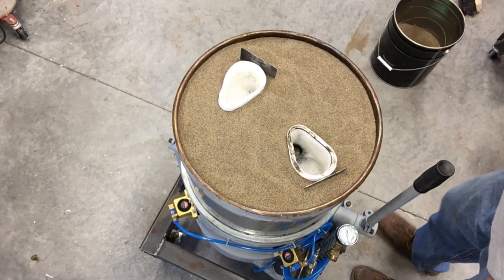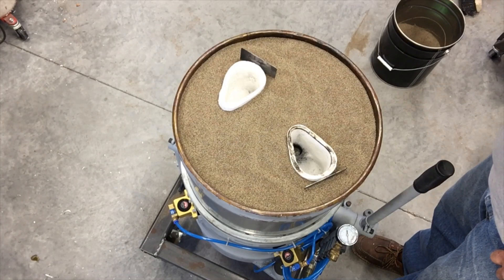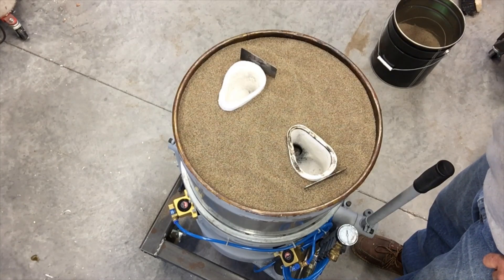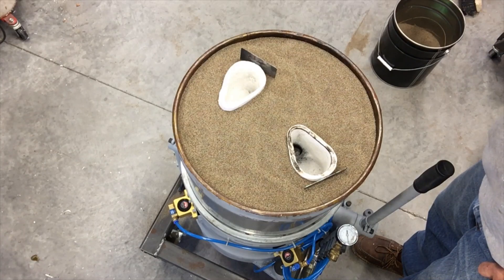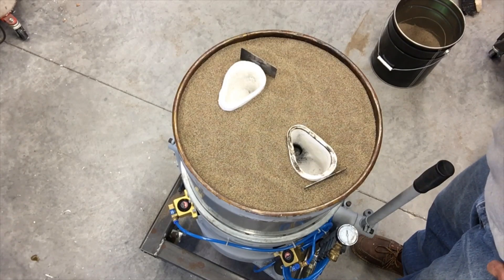The mold is packed and ready to be poured, and hopefully successfully. I've got the A20 all loaded up — probably should be pouring in about 15 minutes or so. It's cold out today, around freezing, and I'm hoping the duration of the pour time keeps me in good shape as far as pour temperature goes. All previous pours have taken 30 seconds total duration, so I'll be over the first one for about half a minute and the second one for half a minute. It only takes me about 10 seconds to get from the furnace to the cup. With the bigger crucible and the A20 I don't think it'll lose as much heat because it's so much more massive, and I get to the cup pretty fast, so hopefully everything will come out just fine.